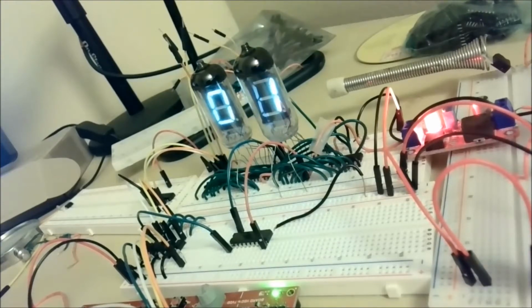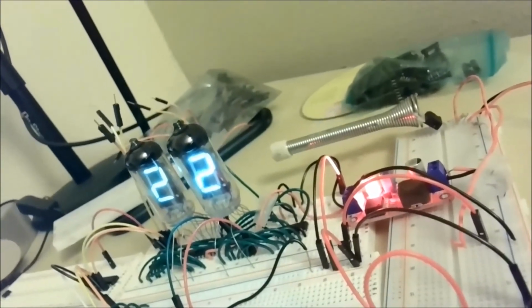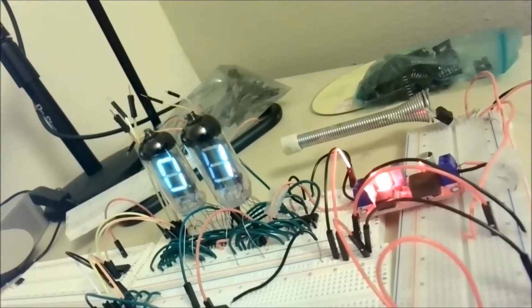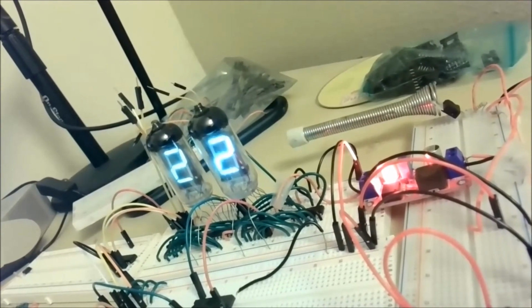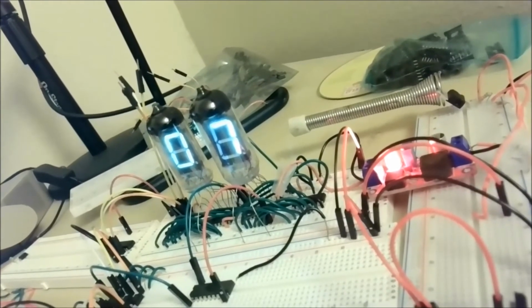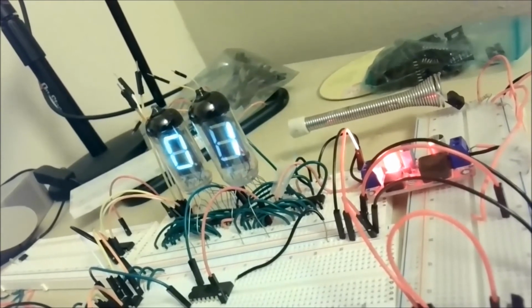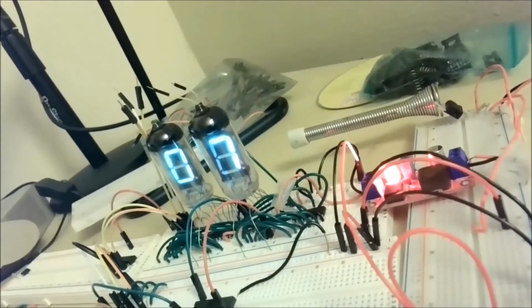But what I want to address here is that, over to the right here, see that regulator at the end of that breadboard, and it's got basically the door stopper hooked up to it. I was trying to figure out why this is the 1.5 volt regulator. It's a 317T adjustable regulator set to 1.5 volt output. Now, the input voltage coming in is 12 volts from the DC wall wart. And the problem is I didn't really realize how much power that thing is going to dissipate.